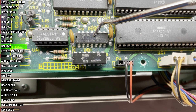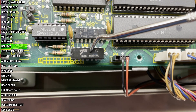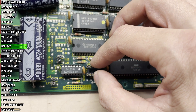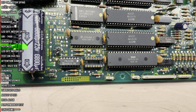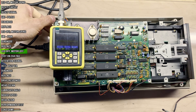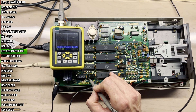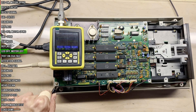Now on this particular drive the chip on the board is a 7416, but I'm going to swap it out for a 7406 as per the schematics. Spider Bob sensei is here making sure everything is within proper specs. Power on — and the motor stopped spinning. Let's take a peek at the pins and see them on the scope. The input is okay, that comes from the first chip. The output is also okay — it goes from high to low and then rises again with its capacitor, C46.